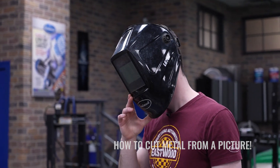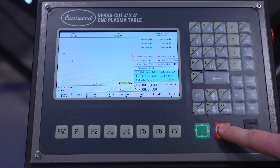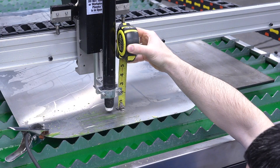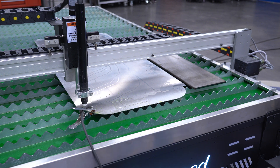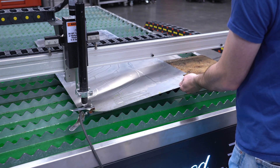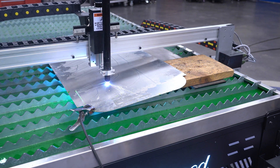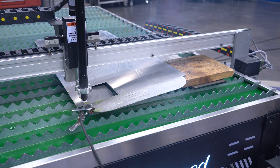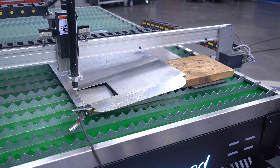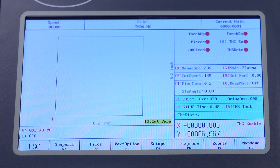I like to throw on a welding mask and watch the beam length to know if I'm in the right zone, but you can be more scientific. Press the red stop button mid-cut to pause, then you can measure the height — if it's somewhere between 1/16 inch and 3/16 inch, you're in the right zone. For a good test I'm going to add some slant to the material and run a part. The result looks pretty good — the torch kept the height level the entire time.